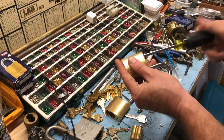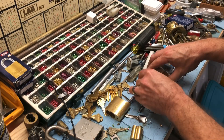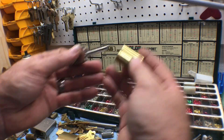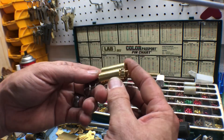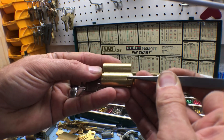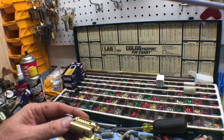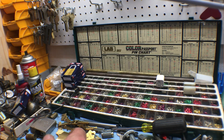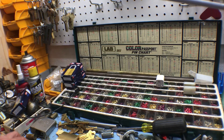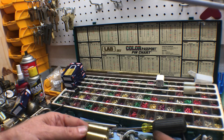Let's go ahead and take this one apart too, same way, so we can see the difference between Weiser and Schlage - this is just for Weiser from what I found. When you're rekeying this, we're going to turn it, push this retainer in, and then turn it the rest of the way, which exposes the chamber holes there. We'll go ahead and remove that - this makes it easy to rekey. Of course you can take the clip off and rekey it that way as well, however you have to be very careful.